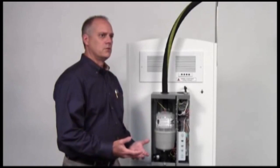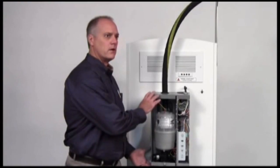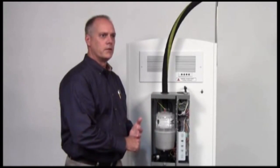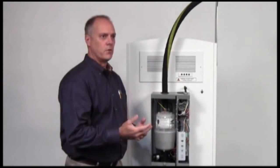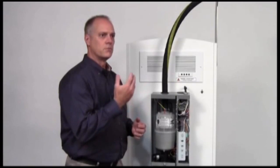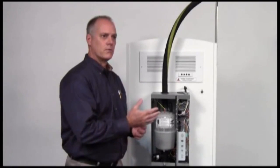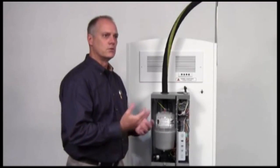The unit is very simple and easy to install. The base steam unit can be mounted in conditioned space — in your closet or HVAC room. The steam dispersion unit can be mounted up to 30 feet away, so it can actually go through a ceiling into an attic, through walls to duct work, or around a simple corner to your supply.